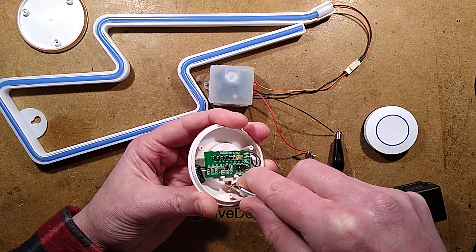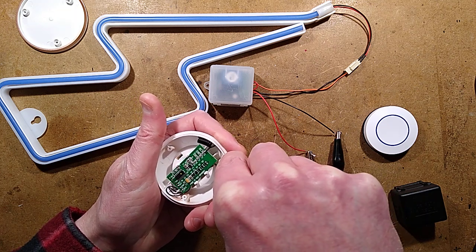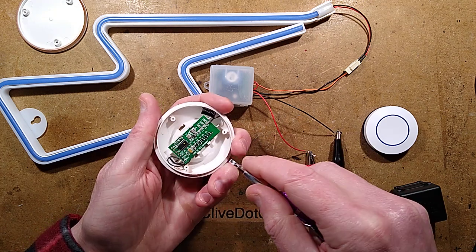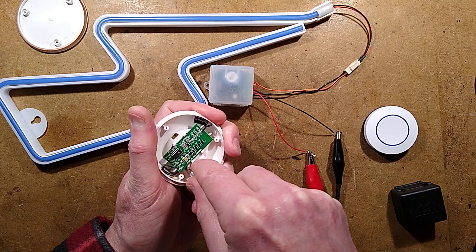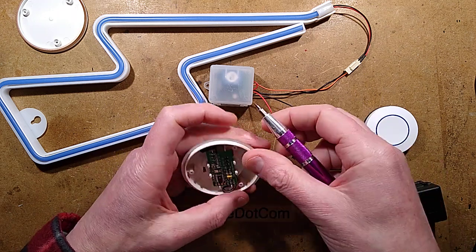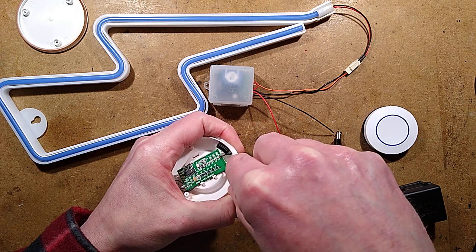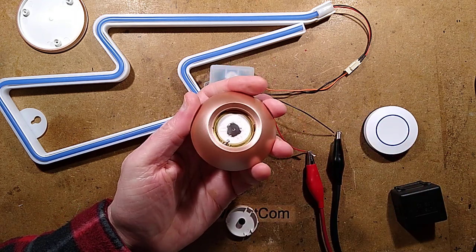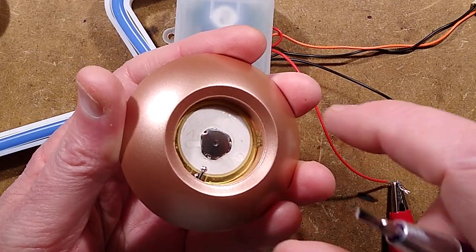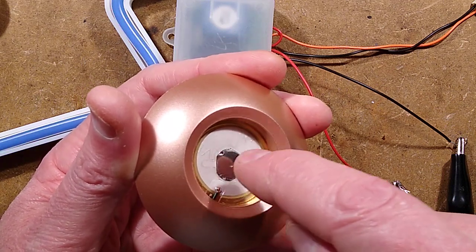It's very different to the other one. It's what I thought the other one was going to be, and was kind of surprised to find out it was magnetic. Not just magnetic, but I've discovered since that it may be based on an old dynamite blaster control clicker. It locks in a piezoelectric crystal disc. The reason it felt like a standard tactile button is that in the middle of this piezoelectric disc is indeed a tactile button - just the dome. It's not actually doing anything electrical; all it's doing is striking the crystal.